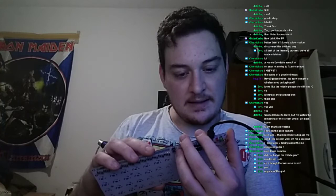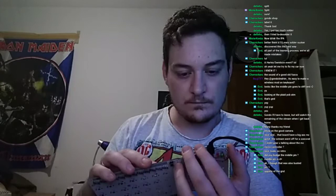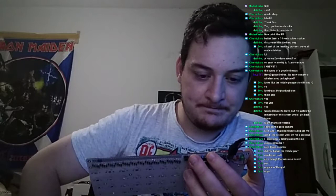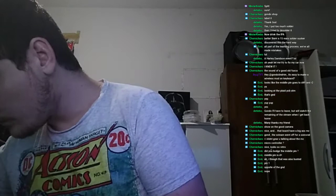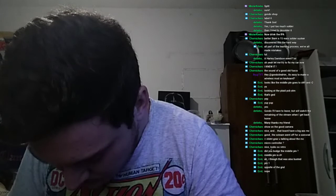Is the connector shield grounded? Because I'm looking at a connector shield pad here, and it looks like it's connected to GND. If it's grounded, I can make another jumper to ground, this time using this better grounding. Nope. Damn it. Let's do a continuity test. Yep. Okay, so let's see it. Well, GND is there. GND is getting continuity.